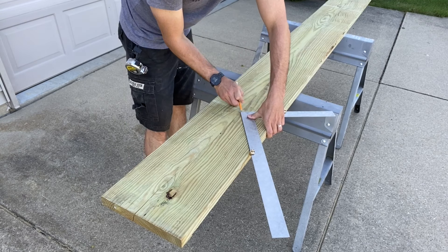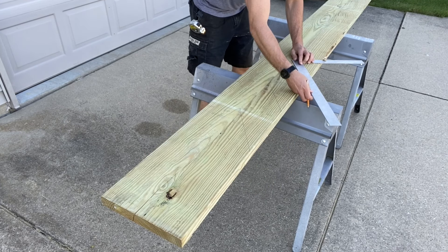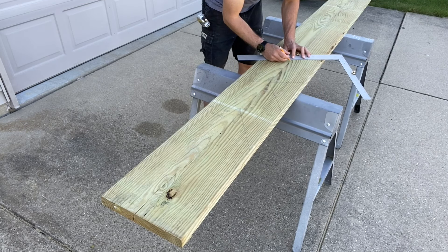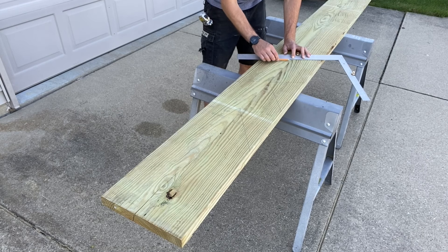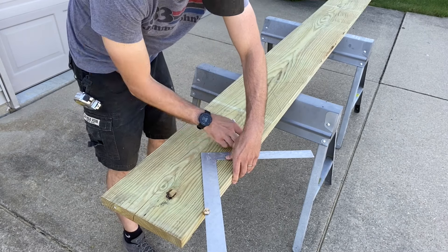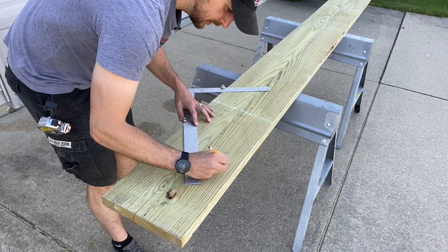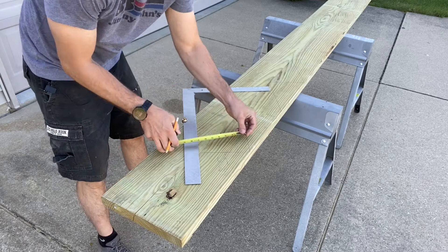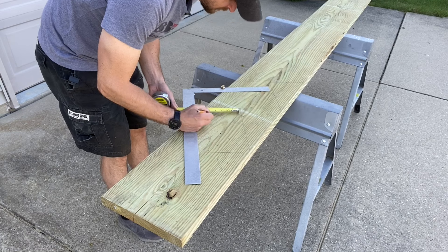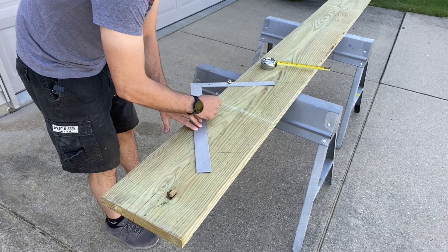I'm offsetting a little bit here because of a crack in the two by twelve. Taking the framing square with the gauges set to your rise and run, you just trace the outside for as many steps as you need. That top line I'm just going to extend down because that is actually going to be the back surface. For the start of the stair, instead of seven and one sixteenth, I'm using five and thirteen sixteenths because I'm going to add one and a quarter inches of tread on top, which gives me the correct total height.